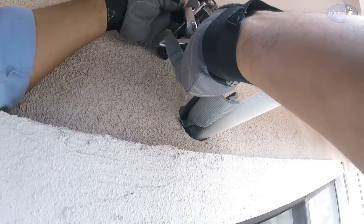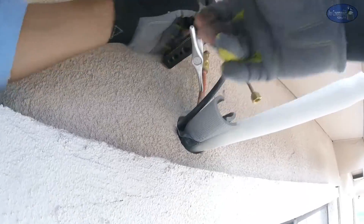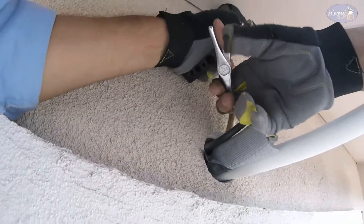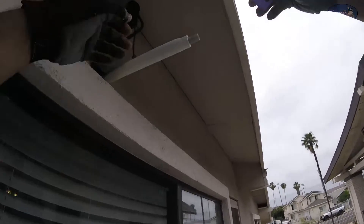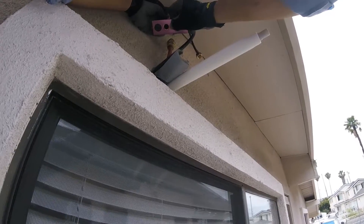You know what this is for, right? So that it goes in there, you turn it and it stops by itself. I have to make sure it's centered. I tightened it to where it stopped, then I make sure it's seated, and then I can give it more. This one is really tight — it's hard to do this. I go until it stops, then come back and give it another turn, and back again. For the 5/8, it has to go in and stop at the midpoint — see, there's a little line right in the middle.